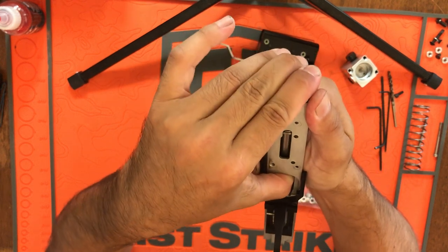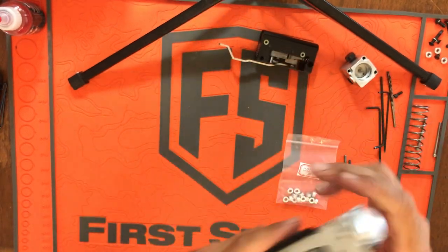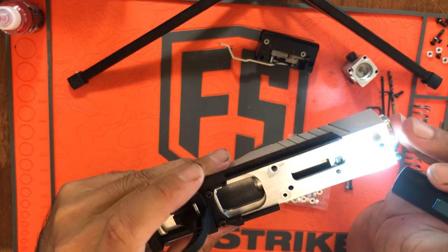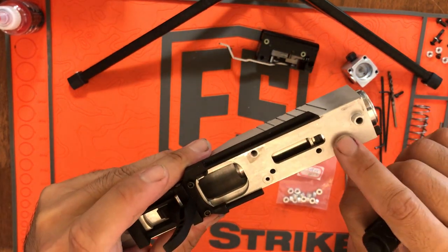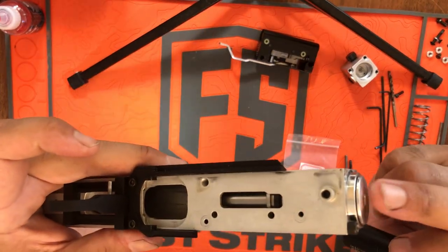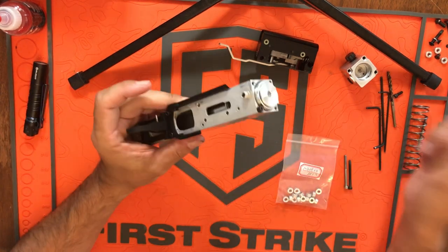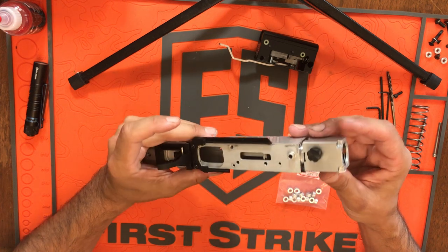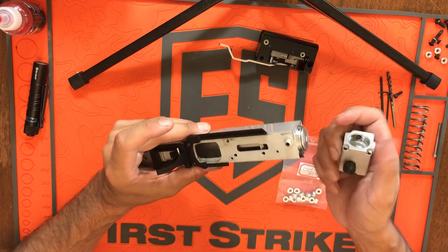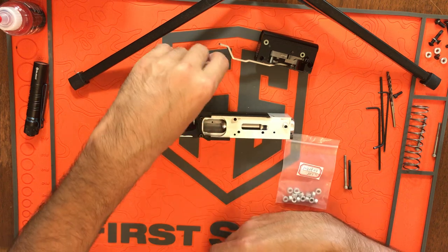So I just passed the first O-ring, and now I am right on the hole. It might be hard to see, but this air inlet hole from the regulator matches the air inlet to the air chamber. What I did after this is I measured, with this rear adapter in place, what the distance was to keep the chamber secured in this exact location. That turned out to be 4 millimeters.